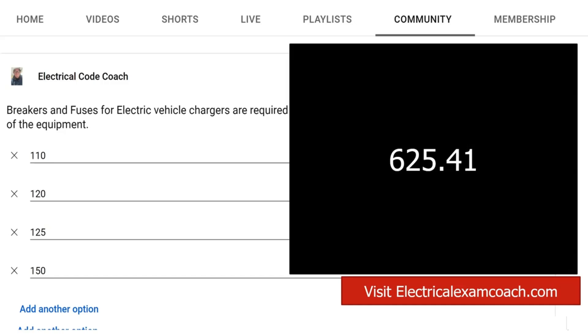625 is going to be all about electric vehicle power transfer systems. It's not just electric vehicles — it's also about the electric vehicle power transfer system, because we're going to be transferring back and forth from the grid, charging one direction and supplying the house in the other as the future unfolds. EVs are a walking generator, or a rolling generator, so that's something we're going to have to be aware of.